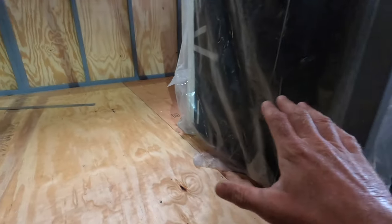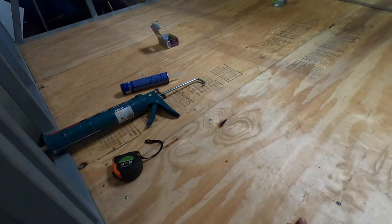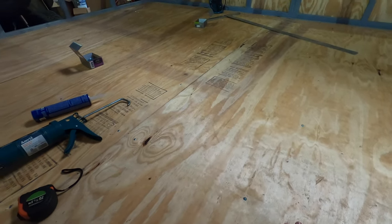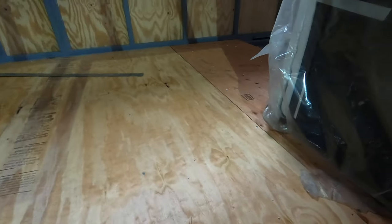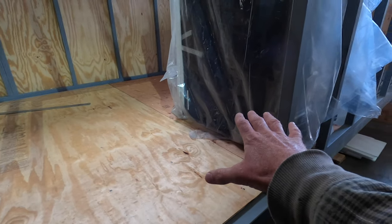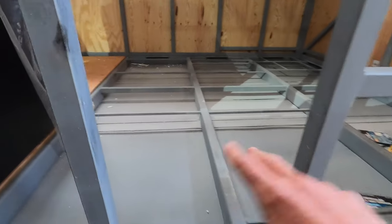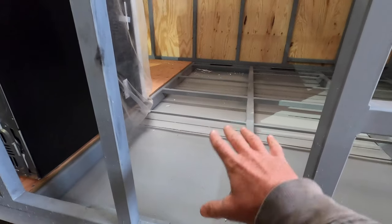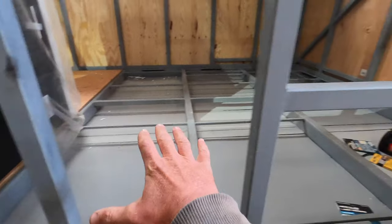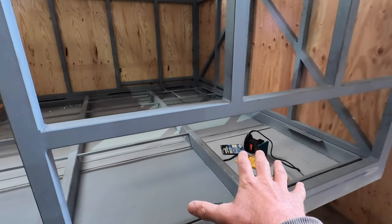Part of the subfloor is in. This has all been insulated, glued, and screwed. On top of this is going our radiant floor heating, and then another layer of flooring for the finish. There's four inches of foam insulation in here plus the wood, so again excellent thermal break there. These sides I have not finished yet. This bay is going to be for a lot of wiring, some plumbing, that kind of stuff. I've got a toilet over there and a shower in the corner, so these will all get done as we move forward.